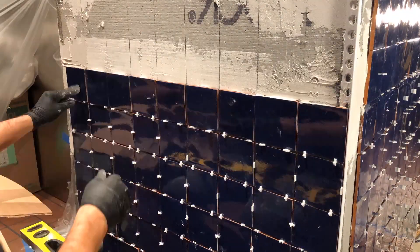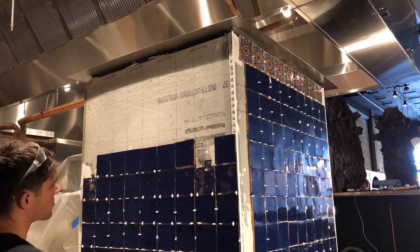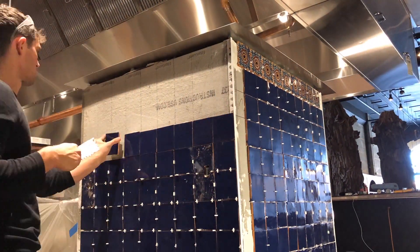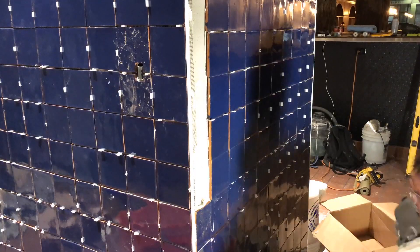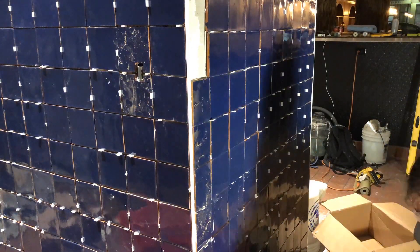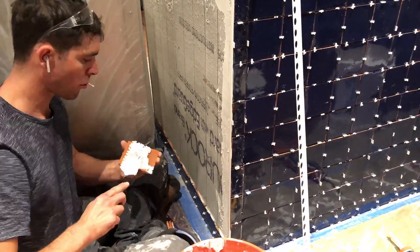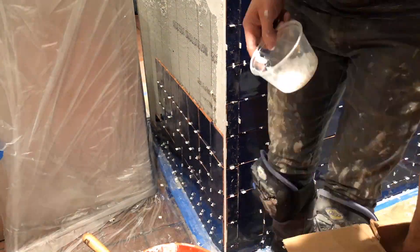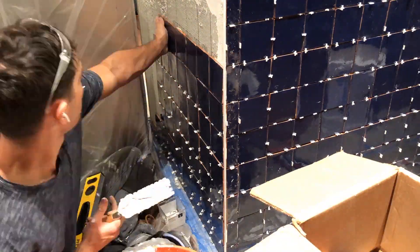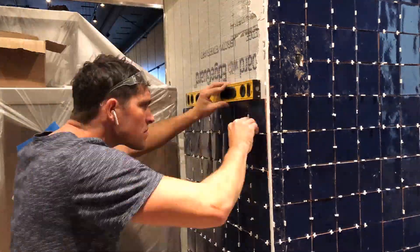The nice thing was that I was able to utilize those wedges to really gauge how high I wanted them to go gradually, versus having a specific height I had to hit every single time. I have a link in the description box below on where to purchase this tile, but if you like this look and style, just know that you will want to have those wedges. Because of that alignment approach, I found it easier to back butter each tile, install it into place, and then use my level to level everything out — it potentially took a little longer, but it made my life easier.